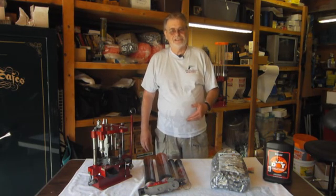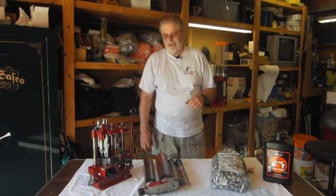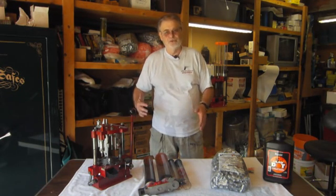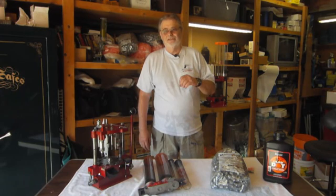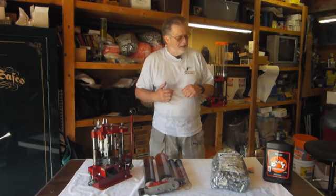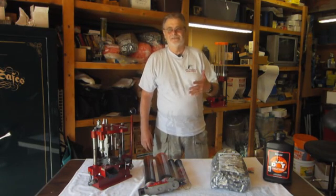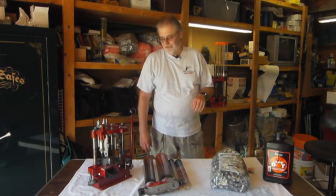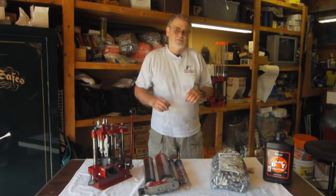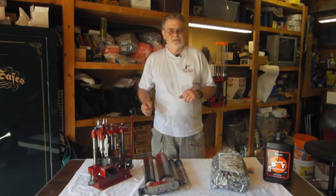Basically, I have 2 366s. I have one set up for what Steve refers to as my bunker load, but it's really just a fairly fast trap load. And I have one set up for skeet. The reason I have the 2 doing the separate loads is that the skeet load has so much less of a faster powder in it that it would not crimp correctly. Steve was talking about having crimps that dish down and have a big hole in them, and I had several where I would get done shooting a round of skeet and have a pocket full of shot. So I got my second press set up, and I'm making pretty good looking skeet loads now.